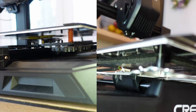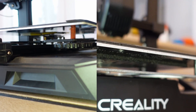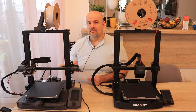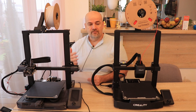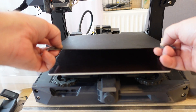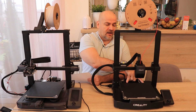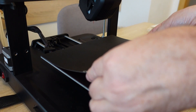The V3 has thermal insulation from the bottom on the heated bed, so we will likely lose less energy with this version. For bed positioning, on the S1 it is approximate, but on the V3 we have screws as aligning pins and grooves, so we can always place it back in the same position.